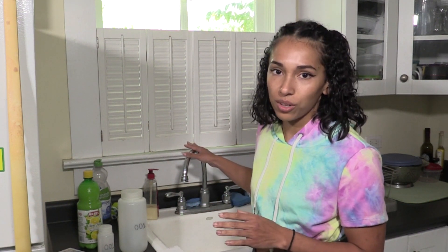This is very important. Before you collect your sample, you'll want to choose a tap in your home that can remain unused overnight. Make sure everyone in your household knows not to use that tap for at least six hours. They can use other ones, but not that one. This is so the water will have enough time to accumulate any lead that may be present in your pipes.